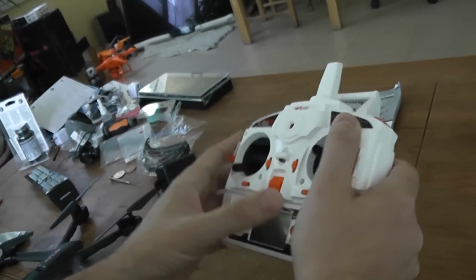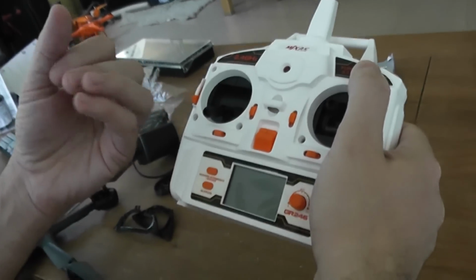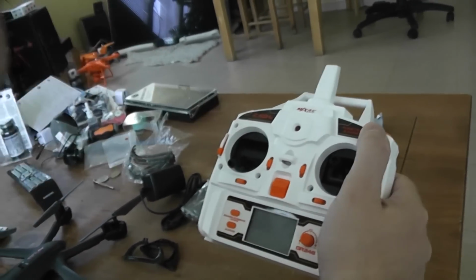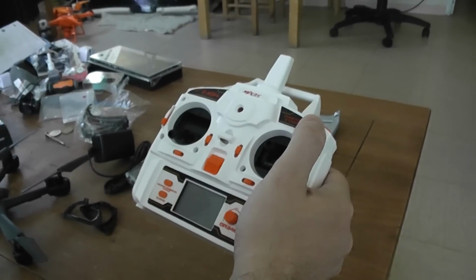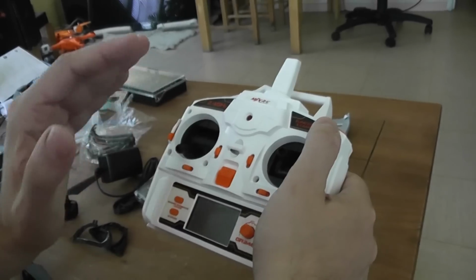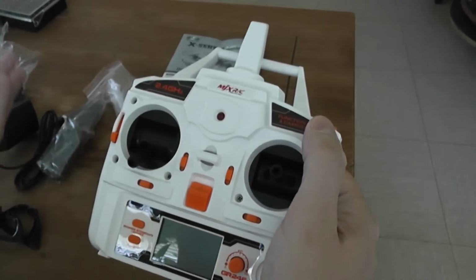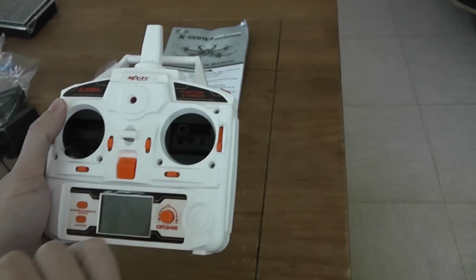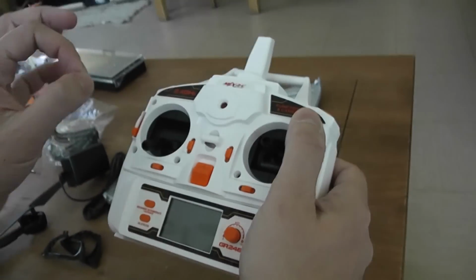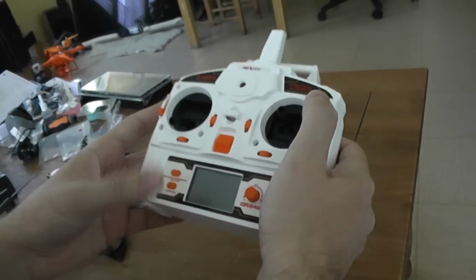One important point: when I disassembled it, I was really positively impressed by the build quality of the radio frequency chip. For example, the daughter board welcoming the RF chip, which is XN297, is completely wrapped in copper paper, and the ground was soldered on this copper to have a common huge ground, so it's very good. And on the antenna you also have a foil one to maximize the control range.